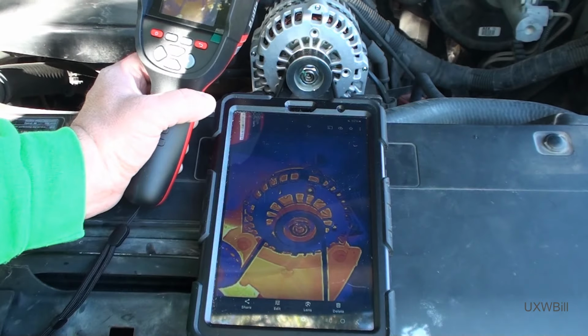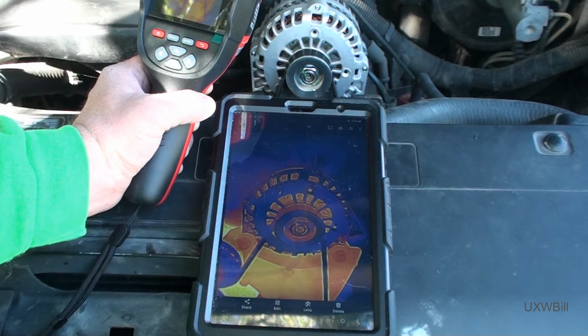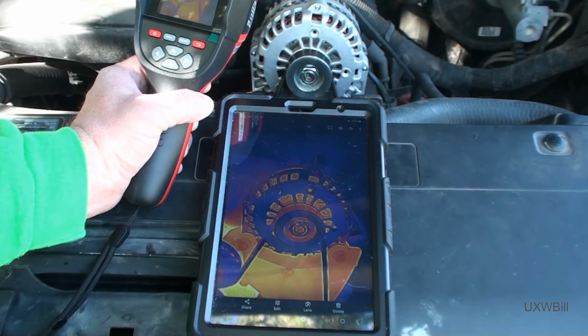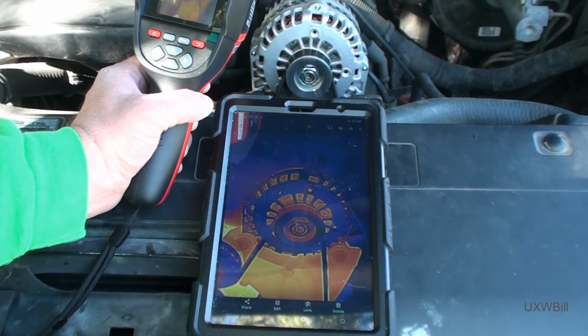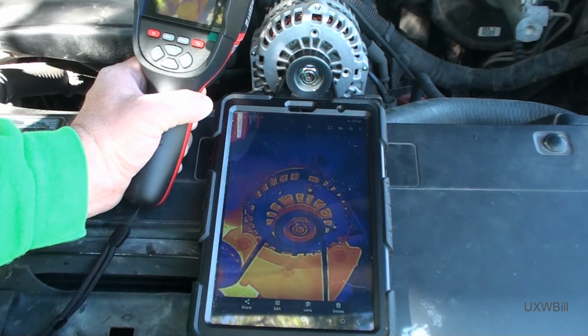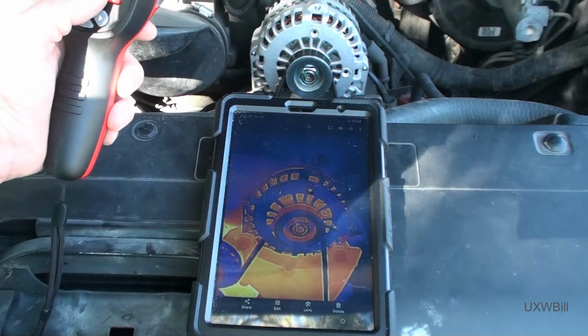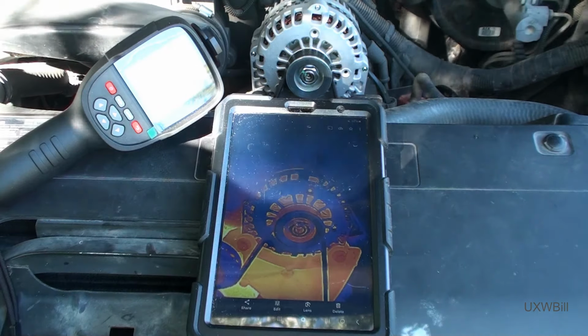And as far as accuracy and comparability of measurements is concerned, the two do seem quite close to one another. I'm measuring temperatures in the range of 107 to 121 degrees Fahrenheit, and both cameras report roughly the same readings in the same areas. I'll go ahead and include pictures captured from both devices in the finished video before we go on to the next segment.